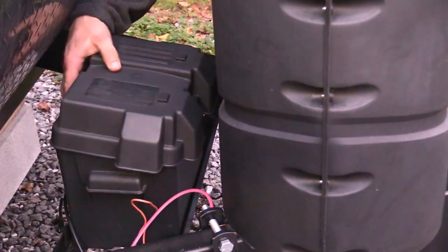All right guys, there you have it — completely done, you are ready to go for next year. It's completely safe, there's no antifreeze in your lines, which I do not recommend. Leave all your spigots open, make sure all your lines are water-free by putting air through them, and make sure your bypass on your water heater is in the right position. I leave that little spigot on the water heater open too. You're free to go, guys. Like and subscribe — God bless, and see you on the next one.